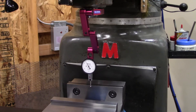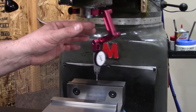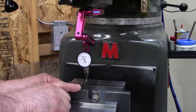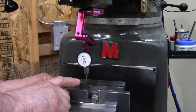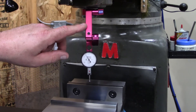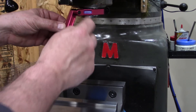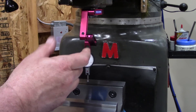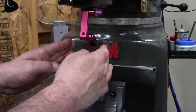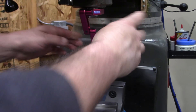You can indicate in your vise with this. You can check the ID and OD of a part. You could also find the center of a pin if you need to get right dead center, and you can indicate around that pin. Another thing I really like about this indicator holder is that it does not have rods — it's got these joints here. With rods, if you don't have everything tight it could slip, but this is not going to slip. It's a rigid mount, except for your adjustment points, so where you set it, it stays.